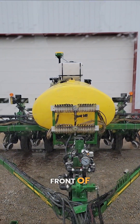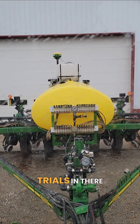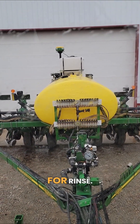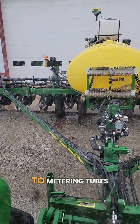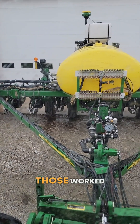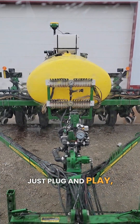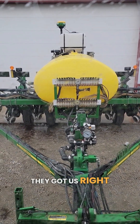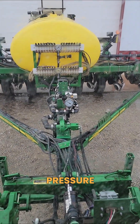You can see the front of the three trial tanks in the back there — we'll be putting some trials in there along with some water for rinse. The Raven rate controller is working great. We ended up going to metering tubes this year; those work better than I expected, honestly — just plug and play. Work with your salesman on that; they got us the right size tubes.